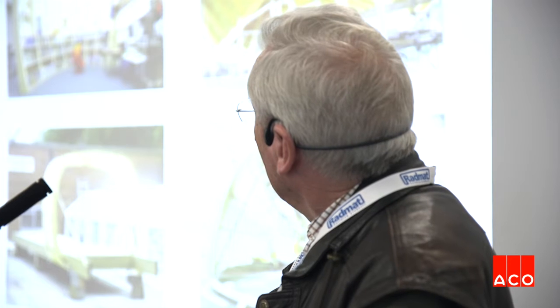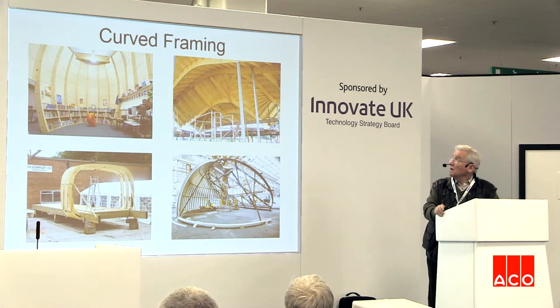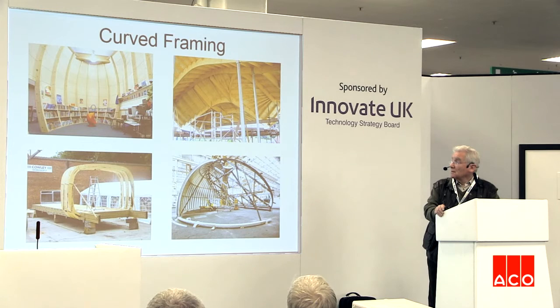On the top left there is a much simpler version where we've just edge-jointed 50 millimetre solid timber and profiled it to the shape the architect was seeking. On the right-hand side of that picture, the building goes alongside a corridor with a flat wall where pedestrians go past, and the ribs are shaped accordingly. Similar construction is used in the one below it, where members have been cut roughly to profile, laminated edge to edge, and then profiled to varying shapes. The whole structure disappears in use — in this case it's a mobile classroom.